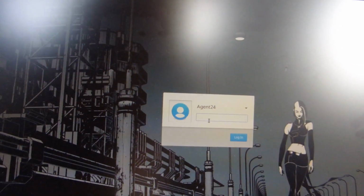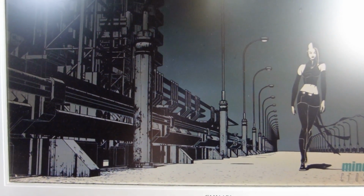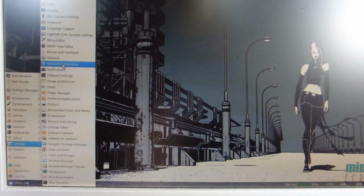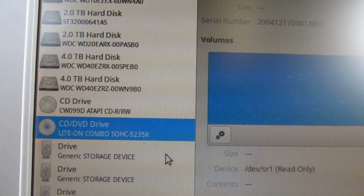Alright, so just as a quick test, I've plugged those two drives into the other card, which is obviously working fine. I'm just starting the computer up now. There's no POST message for that card because I don't think it has an actual BIOS on it. But if I bring this up here, I can have a look in the disk manager and see if it makes sense. And that will prove if it's the controller card or the disk drives themselves. Let's see, disks. Yeah, and if we have a look at that, both of those drives are actually coming up correctly. So that's with the same cable, the same drives, and just a different card. So it must be the card that's faulty in some way.